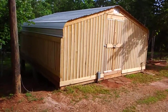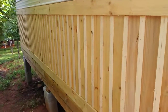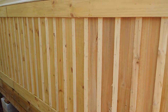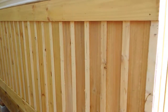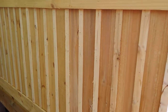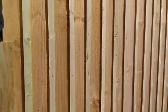I'll walk around to the other side where I haven't finished yet to give you a better idea. What we have used — this is the shaded side — is the cheap eight foot dog-eared fence boards that you can get around here. You get them at Lowe's and Home Depot for about two bucks a piece. They're roughly five and three quarter inches wide and around three quarter inches thick, and they are a cheap treated board. There's no structural value to them, but for siding they're perfect.